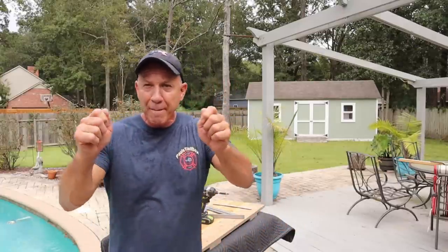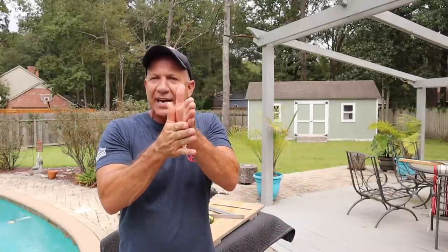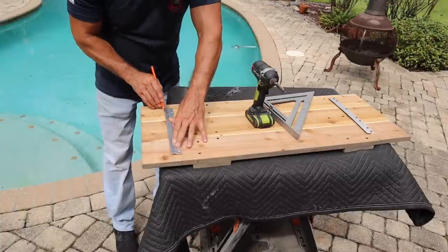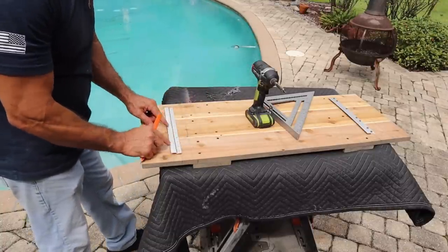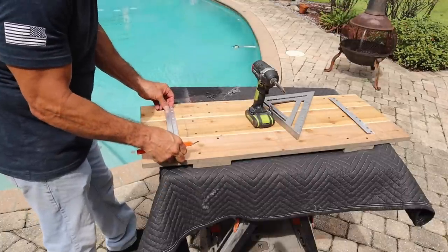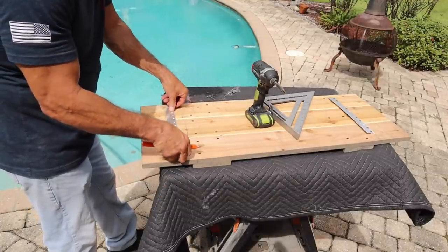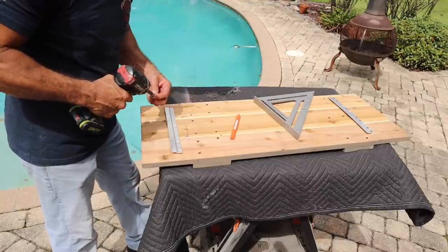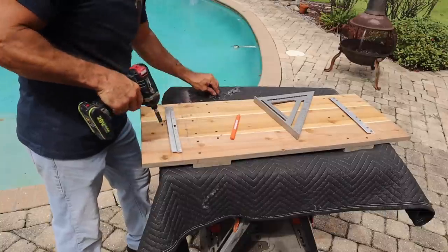Now this is super important: these shutters slide onto the house. Some of them I have room up top and I drop them down — those are really simple, even easier than these. The only thing I have to do on this one is make a slight adjustment: my bottom French cleat has to be raised up a tiny bit on the shutter to give me room because I'm sliding it sideways. I don't want to fight it — I want it to slide in place. It'll still hold but it won't be super tight on the bottom so I can just slip it right on. I'll raise it up just a tad — about an eighth of an inch — and that gives me enough room.